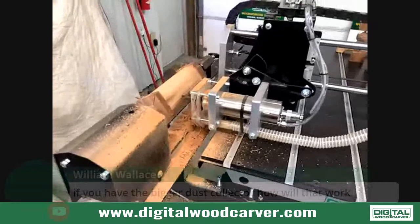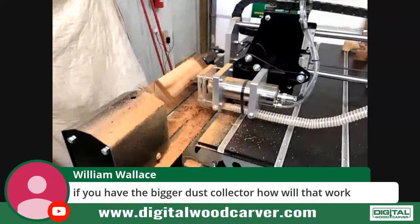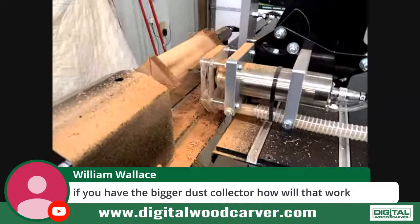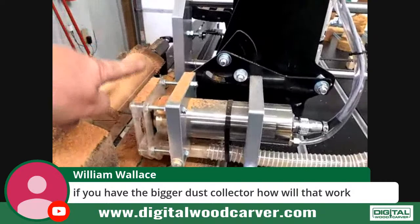And William Wallace, if you have a bigger dust collector, how will that work? All right. So Mike, what you're referring to is the dust hood is on the bottom side of the router. And it's the standard 1.25-inch dust hood. Well, when you have the 2.5-inch dust hood, you simply take that vacuum housing, that clear acrylic housing, and you rotate it 180 degrees to where it's at the top.